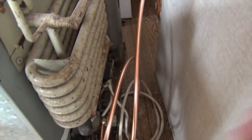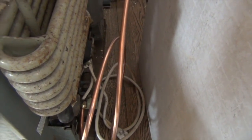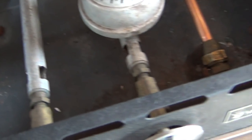So what I've done here is I've given it a generous coil. It makes it nice. You know, this bends really easily when you move it around. It kind of goes in there. I've run these 3/8 inch holes right out the bottom, right by where the sheetrock or the paneling is going to go. And as you can see behind it, I'm not going to move this, it's real heavy, but we can back that out. There's the other line for the range, and that goes down into another hole, and that coils around a big coil right there. So I can actually pull this range out. I can unhook it from here. I'll show you. Lift it. So that's where it plugs in.